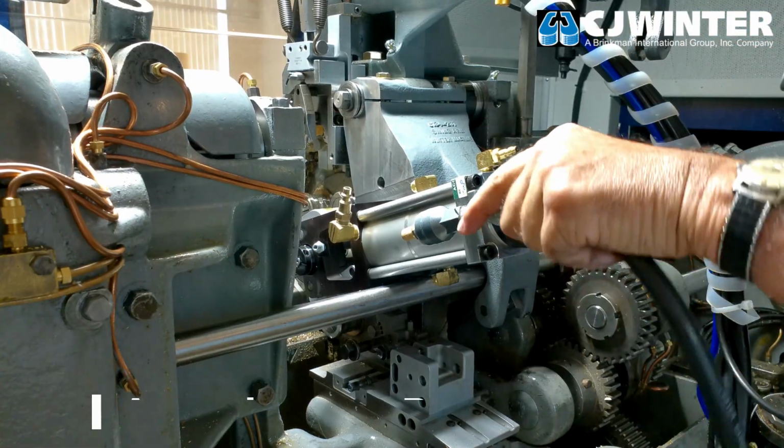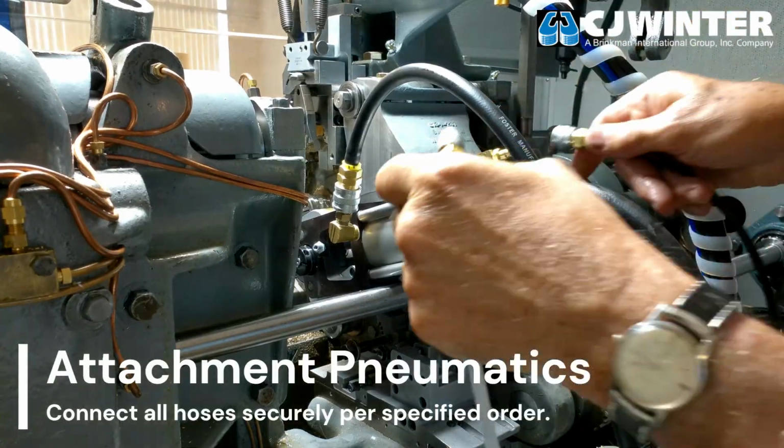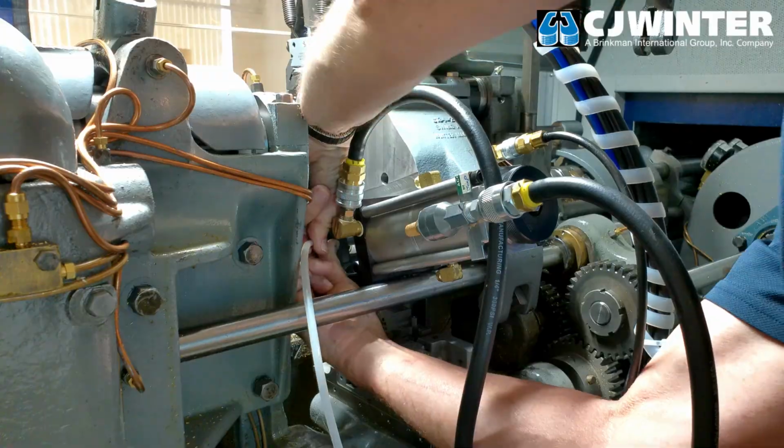Next, connect the attachment to the pneumatic control system using the air lines for the power pack. The clear line is the chip purge line. This line should be connected for operation, but will be removed for the remainder of the testing of the attachment.